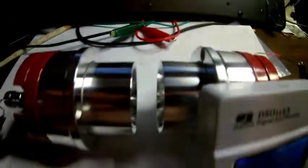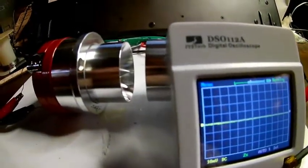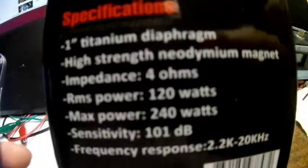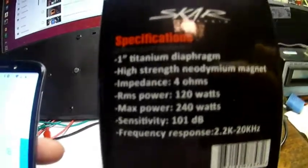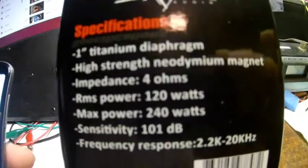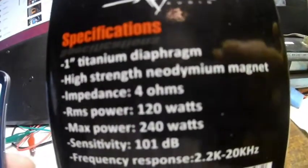I have the speakers back to back, so they should have the same transfer function — sending and receiving. Let's do some calculations. The speaker is about 4 ohms. Of course that's frequency dependent because it's an inductor in there, and those are always frequency dependent. But we'll use it as an approximation — it probably has some resistance too, so maybe it's about 4 ohms.